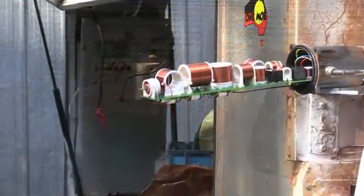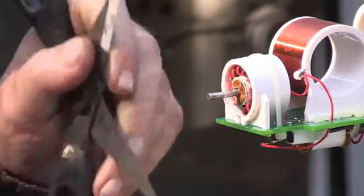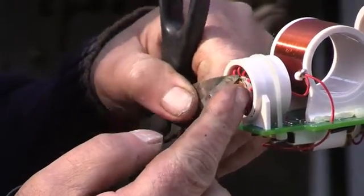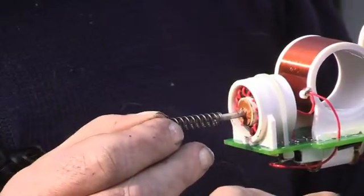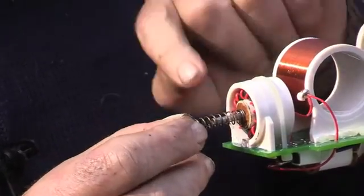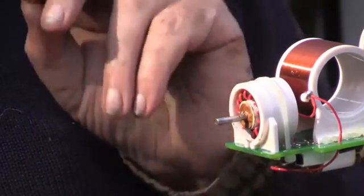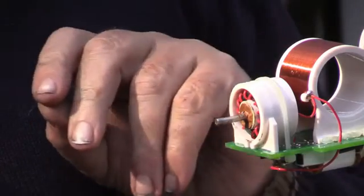You can see the Barrett antenna is now in pieces. I've pulled the top off. If you have a look at the top here, this pin comes through here. What happens is it goes inside the pin on the top. What I've done is I've actually created a little copper washer up here — a very thin copper washer — going over this pin. Then I've got a very small spring to place on the top here. When we push the aerial back together again, this pin here goes inside the shaft on top of the antenna, so it'll have a proper mechanical connection, not just an inductance connection as it had before.